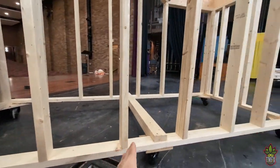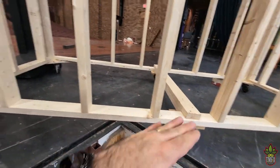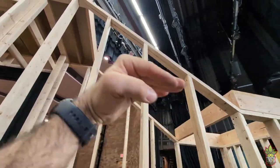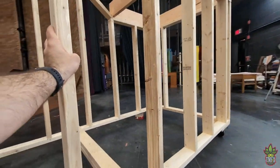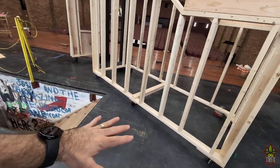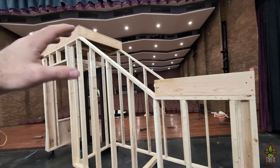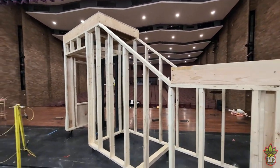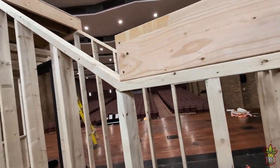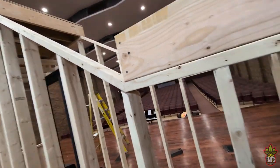Now we've divided the distance between the load-bearing points in half here. We've got a far straighter, more well-supported wall system as a result, because this is all a finite length, and so that's been taken up. It's doubled the quality of the level and the straightness. Level is subjective to the surface we're rolling on, but the straightness of this component, with all this load on it and this dynamically loaded component, is now twice as straight as it was as a result of halving the distance over which it's being asked to span with the same sort of loads. So hopefully that makes sense.